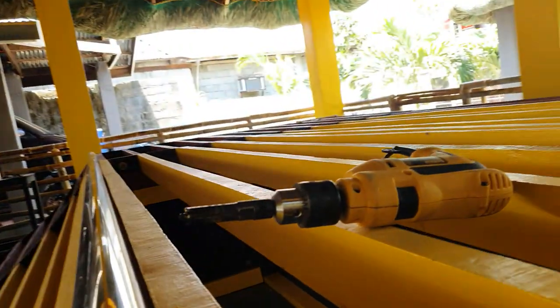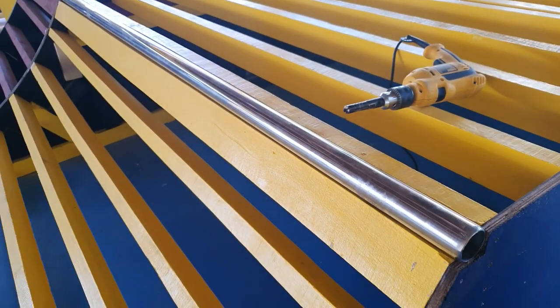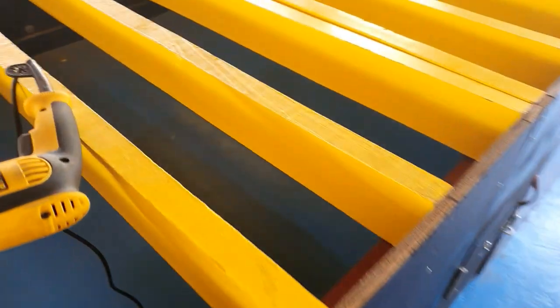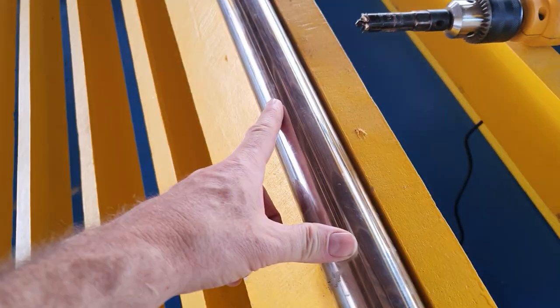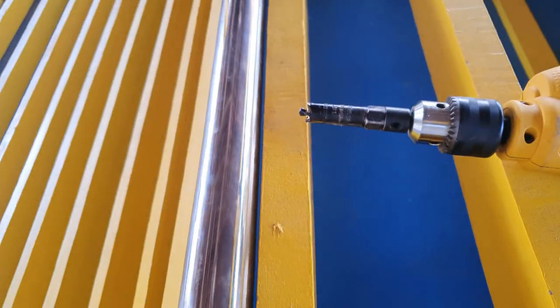We've got the wood inside the coping, and we've left about 6 inches on either side because we're not really going to be hitting that. Some of the other builders will be affixing the coping by drilling holes from the top. Other people actually drill up from the back, which is preferable, because we don't want to put holes on the front. This is stainless and it's going to get sharp, and every time you grab it, you probably risk getting cut pretty bad. So we have to go through the back.